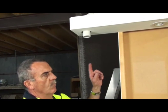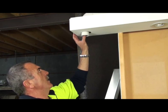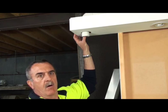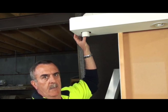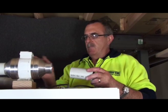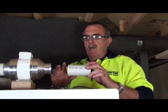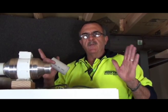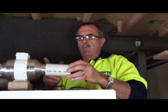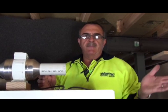In this situation when you're in the rough-in stage, there will be no plaster on your eaves, so you have to measure where the pipe's coming out so when the plasterer puts his plaster on, he can cut a hole in for you so you can place the exit grill in place. After you've determined the exit side of your fan, now is the time to work on the intake side or the suction side. You need to have a piece of pipe for the length that you need to go to the actual suction side — it could be a metre, it could be half a metre long.